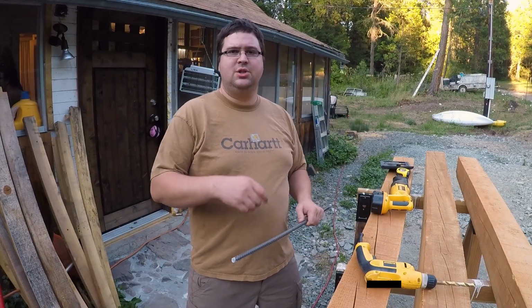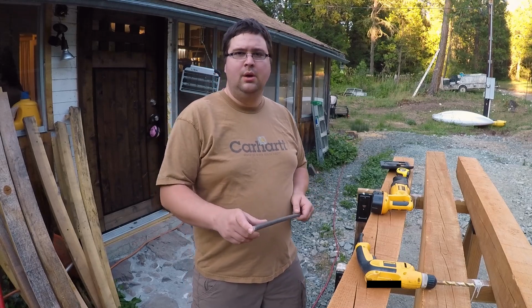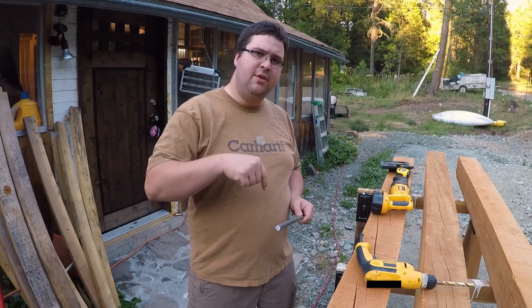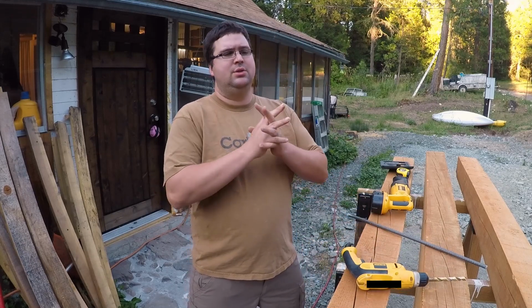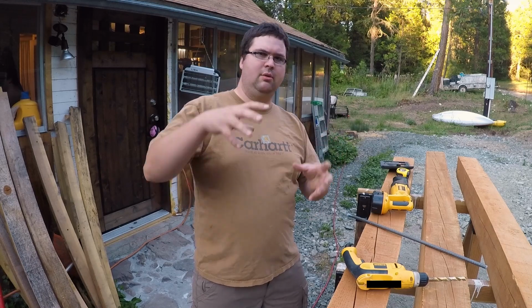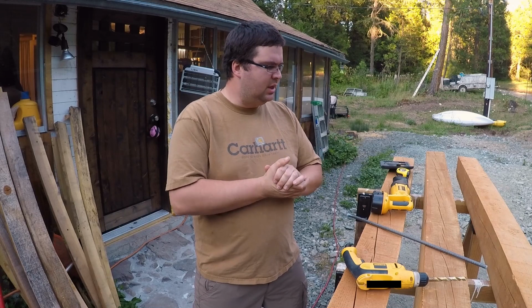So I'm getting ready to finish up the timber frame porch here. I'm going to go ahead and cut a chunk of the rebar off. Part of that will go down the rock. The other part, I will drill a hole into the bottom of the post. And what I'll do is I will scribe that to the rock so it's a nice flush fit all the way around rather than just a square block sitting on a crooked rock. So that's the goal, or the plan anyways.